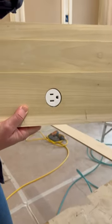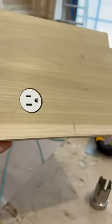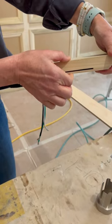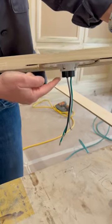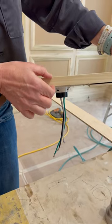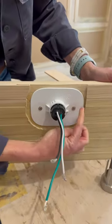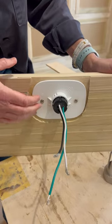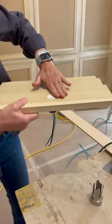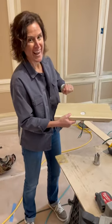That's sitting flush. Now, that's really important. We have an inch baseboard, and this particular barrel is meant for a three-quarter inch baseboard. But here's what we did: on the back of this baseboard, we notched in space for the plate so that this would have a flush install. That's what we're doing right now with the trim carpenters and the electricians.